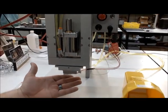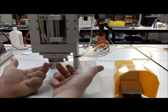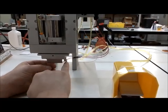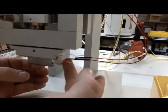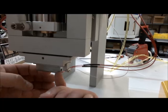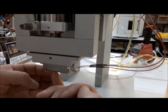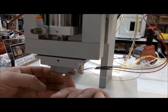This is where the thermode mounts. The thermode is stainless steel and it's bolted into this block with bolts. When you need to change it, you take those bolts out and the thermode comes off. The strain relief right here is attached to the thermode so it comes with it — it's all part of the same unit. The power wires and the thermocouple wire are run through the strain relief. The thermocouple wire needs to stay away from the hot bar — the only point it should touch it is right where the weld is — so that we don't burn the insulation off that thermocouple wire.